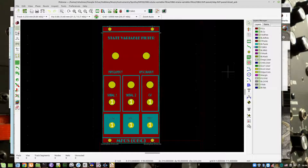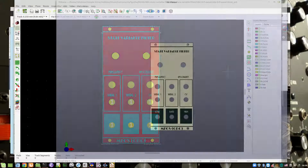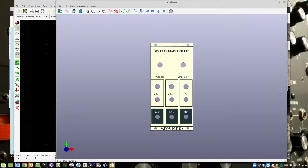The front panel is also designed in KiCAD as if it were a printed circuit board, but without a circuit on it. There's copper on both sides but no circuit etched into it — just solid copper, then a layer of solder resist, then a silkscreen on top, and holes drilled where they need to be. It's a fairly easy and straightforward way to produce a front panel that I think is better looking and more accurately laid out than anything I'd be likely to do on my own.